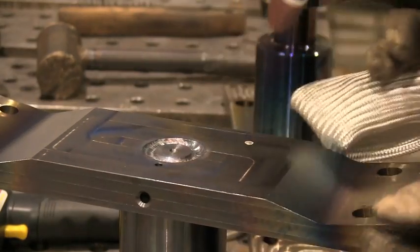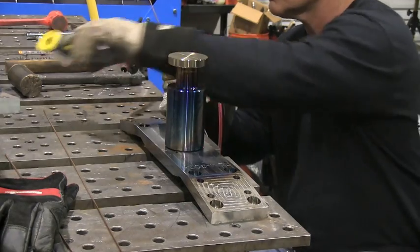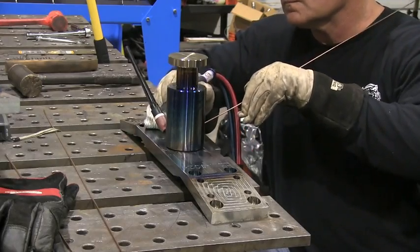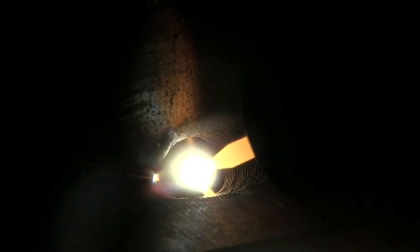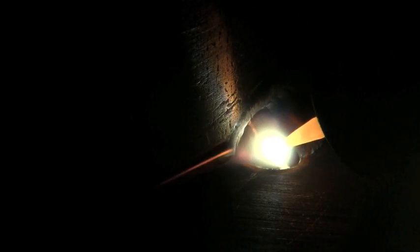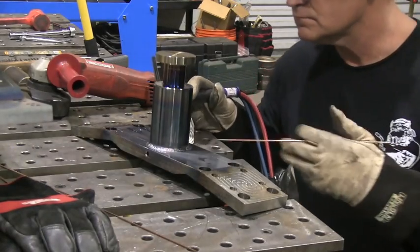So that's what we did last week. There are 20 of these to do — I'm just working through one of them. After the pass on the back side, a quick check to make sure it was over 500 degrees, then I put the first pass on this side. The first pass uses a lay wire technique — leaving the rod in the puddle — because I'm using about 160 amps which is plenty hot to flow metal down there even with the rod in the puddle. I also showed an alternate technique of dipping in and out of the puddle, watching the front of the puddle wet into the root of the joint. I need to make the first pass big enough to achieve the required leg size on this fillet weld so I don't have to carry too much metal on the second pass.